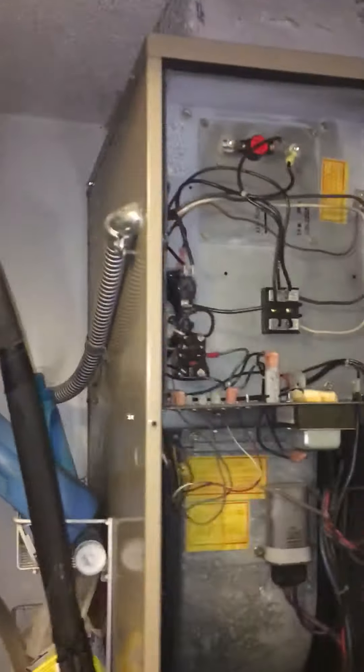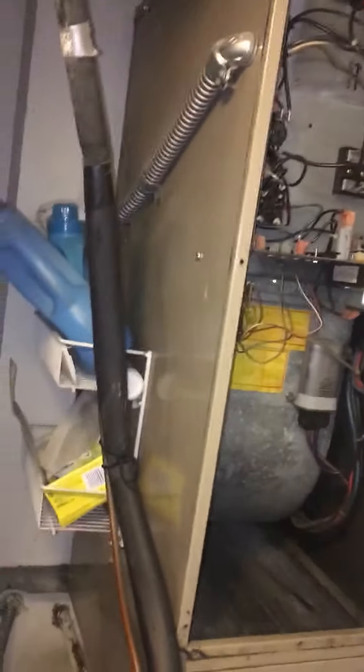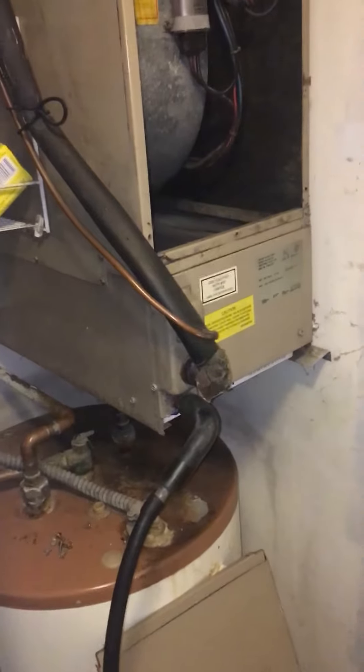It's about 12 inches wide and the depth is right at almost 22 inches. The supply is right up here — the line set will have to be flushed. It goes up into the ceiling, we've got the unit above us, then it jogs over and probably runs over to the side of the building.